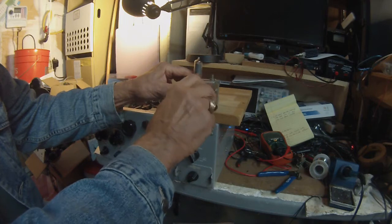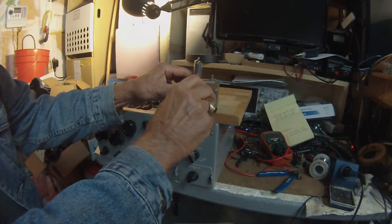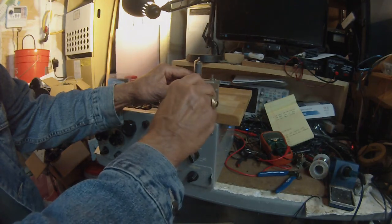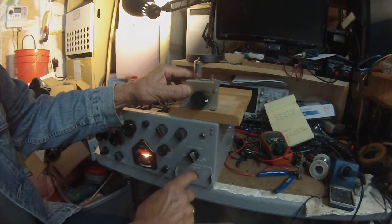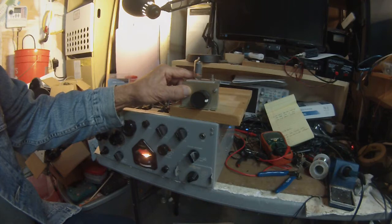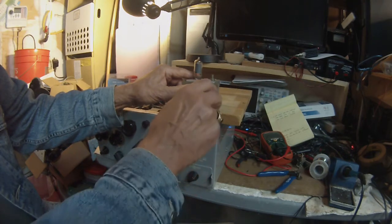This only tunes 100 kHz, and you select 100 kHz segments on this selector switch here, so each position is crystal-associated with 100 kHz. This has two crystals on it for 20 meters — one goes from 14.2 to 14.3 and another from 14.25 to 14.35. So at the time it pretty much covered most of the 20 meter band.